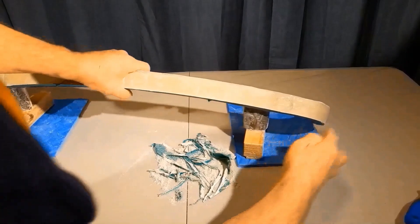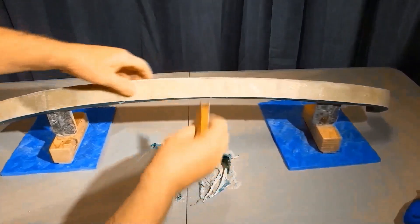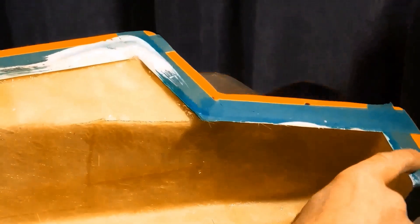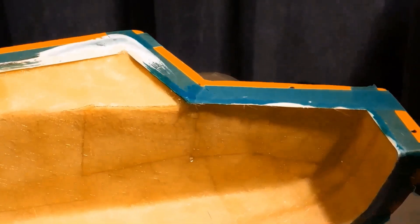After I've done that, I just go over it with 80 grit and make sure there's nothing that can cut the hand and nothing sticking up. On the hull molds, the area from the bow along the shear line all the way along towards the stern can all be cleaned up using the same file method.